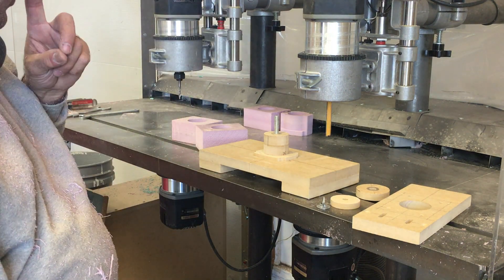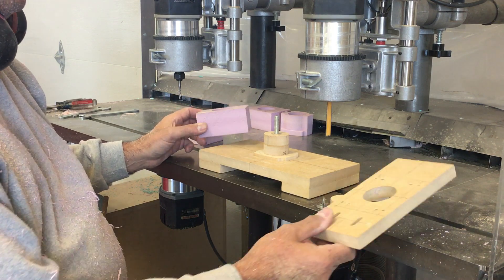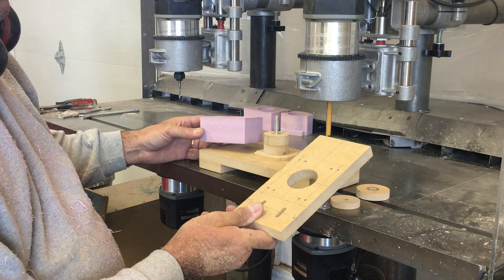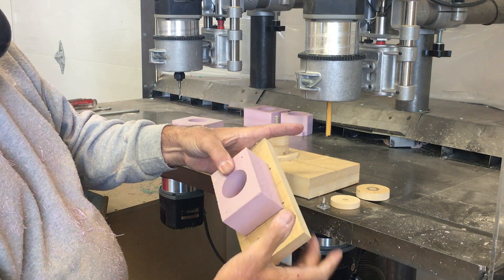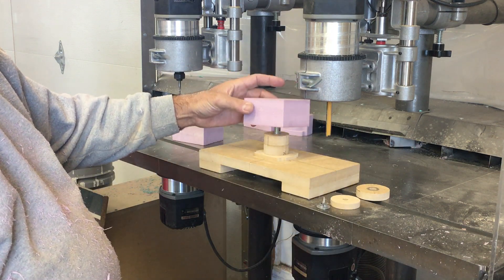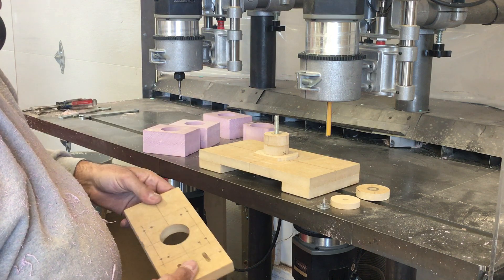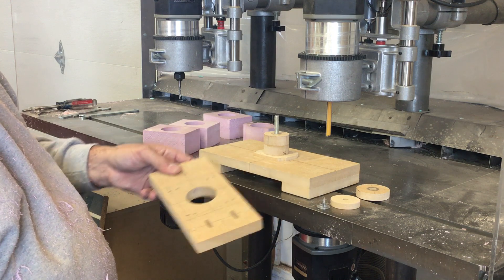Alright, so these are the operations to make the lower base of the cylinder. Sort of like before, this is my kind of do-all jig for roughing out the foam stock so it will fit on the tooling. All I did was mount these little blocks here to this template, screw them on with a couple of drywall screws, and then pattern route in the bore that slips onto the tooling plug there. I used that for roughing out and cutting the stock so it will fit on all my tooling.